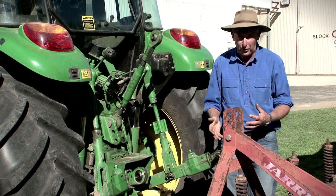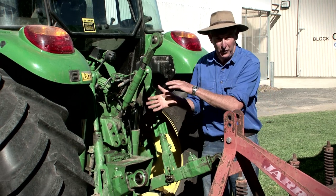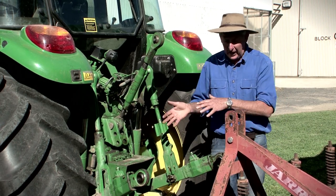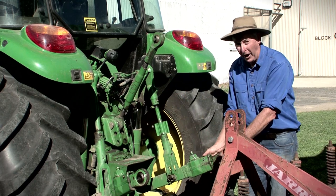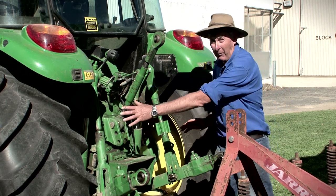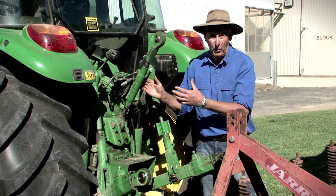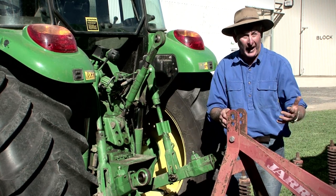There's a certain way that we put on the three-point linkage. The most important step is to reverse the tractor straight onto the piece of equipment. It makes it a lot harder if we aren't directly straight onto it. If we are directly straight, we put the left-hand link on first — bottom one first — then the right-hand one. The reason we go for the left-hand first is it normally doesn't have any adjustment. Once we've got that one in place, the right-hand one does have some adjustment and we can move the arm up or down. Lastly, we put on our top link, and the job of the top link is to keep our piece of equipment stable and straight.